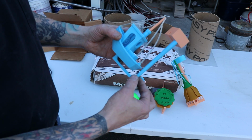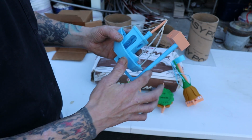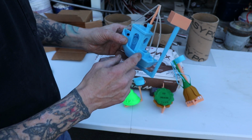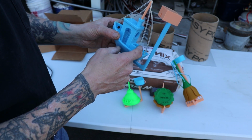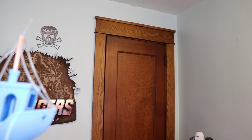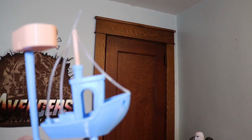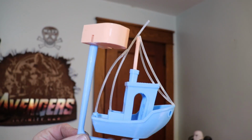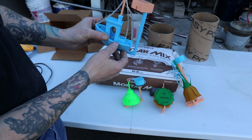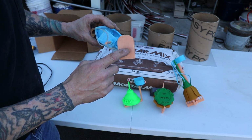One of the things, I've reduced the size of my sprue in order to slow the metal down a little bit, in order for it to feel a little bit more effective. There's also a high spot on here, here, and these guys here that are higher than where I'm actually going to be coming out of the metal. So I figured if I gave it a little bit of a path of some air, it might fill those areas a little bit better. And I also reduced the size of my pour basin.